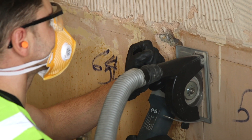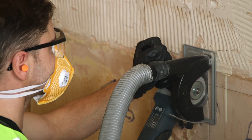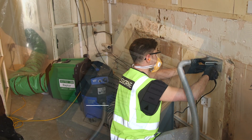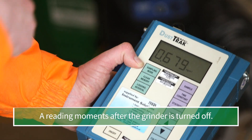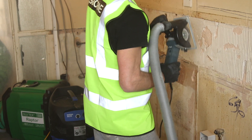If you need air ducted further away, or if a particularly sizeable area is being worked in, larger systems are available. The large quantities of hazardous silica dust typically produced by wall chasing is kept to a minimum, and residual dust not captured immediately is cleared within seconds, thanks to the negative pressure created within the work area.